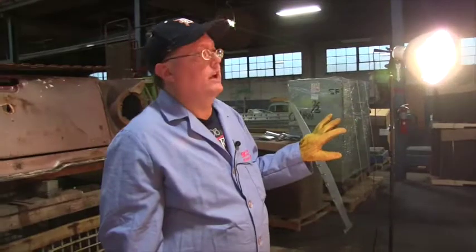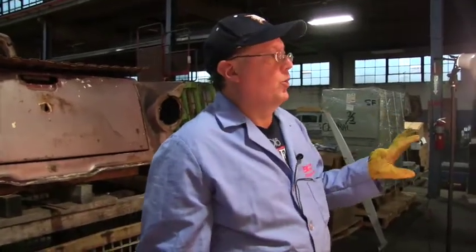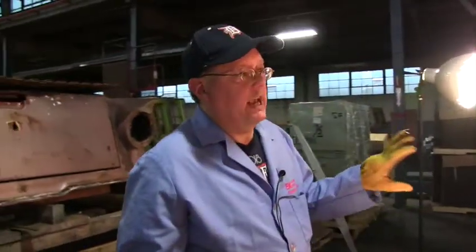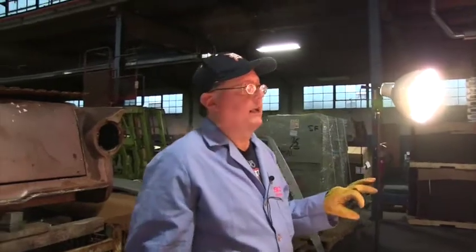Okay, it's just the engine compartments are too narrow. The Fords are short and narrow. The Chevys are long and narrow. Usually when you get into '46, '48, you start to get a more square one. But even then, watch out that the chassis shops sell you some kits that put your engine and transmission too high up and too far back. You will have fit problems. No matter what they say, we hear about it all the time.